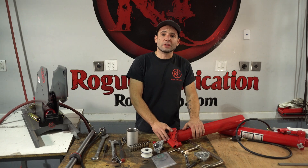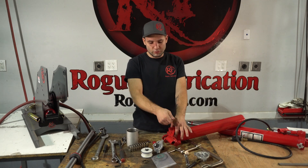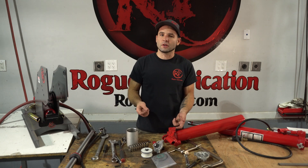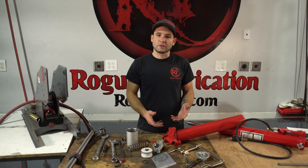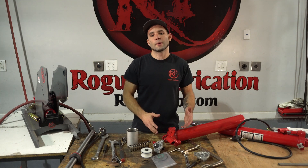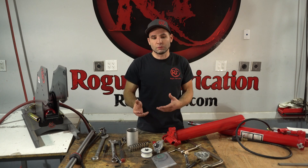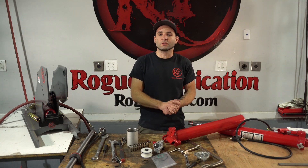The other thing you can do is use a rubber mallet on the casting — not the more delicate reservoir tube — and tap it to free up the ball bearing valves. There are steel ball bearings in a bunch of the valve seats, and those can get stuck depending on oil viscosity or debris. In shipping they can become slightly lodged, and just a light tap with a mallet on the castings can help free them. We do test them before they leave our shop, but if you bought one from another seller, stuck ball bearings are a common cause of returns — and it's not a warranty issue. They're very easy to tap free and get working just fine.